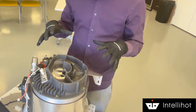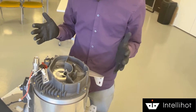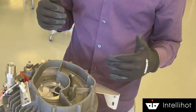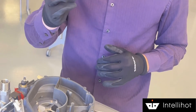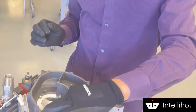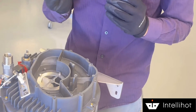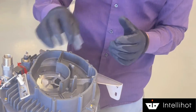Inside this top cast plate, there are a couple of things we're looking at. Really, if you were ever doing this in the field, there'd only be a couple of scenarios you'd be pulling this off. The first would be to check the burner, which is underneath this deflector plate. The other piece would be to check these flappers that sit inside the top cast. They should be sitting in the positions you see them in now — their job is to open and close. If they're laying inside the top cast, that means they need to be replaced; they've broken off their pins that hold them in place.